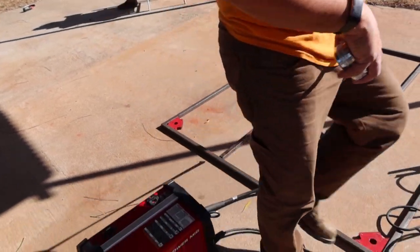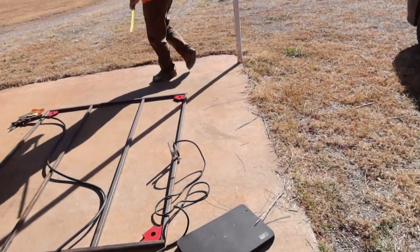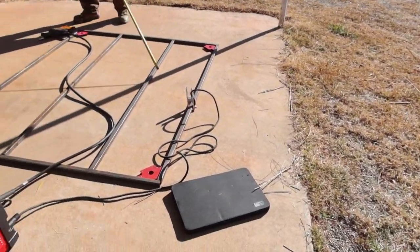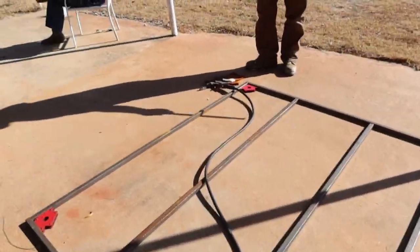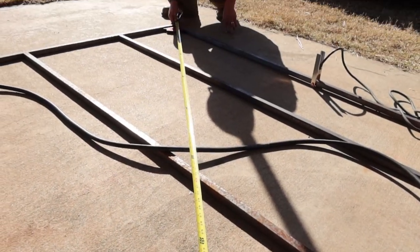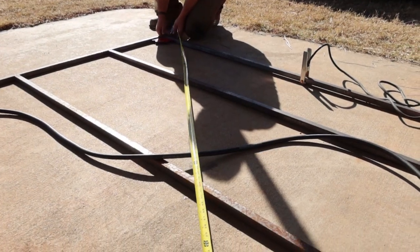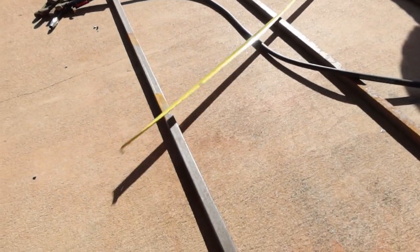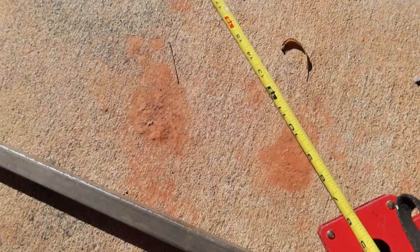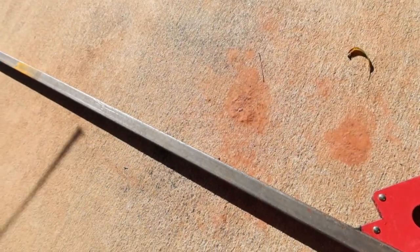It looks like it should be square, right? It looks like it. But let's measure from corner to corner and corner to corner, then we'll know if it's square or not. Yes, let's. Okay. Whoa. What? We're an inch off. This is an inch too long. So put your foot in that corner and you can work too. Really, what are you moving? I'm making it so it's not a diamond. I'm changing the shape of the diamond.